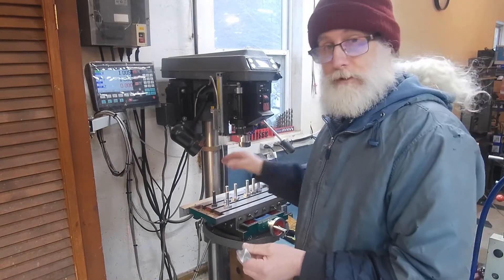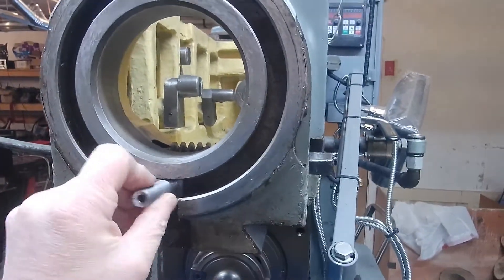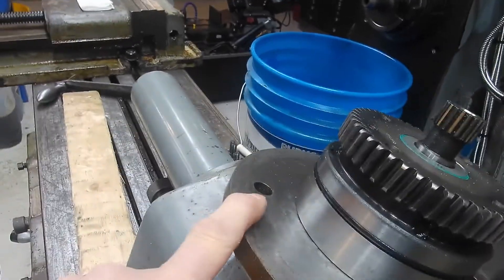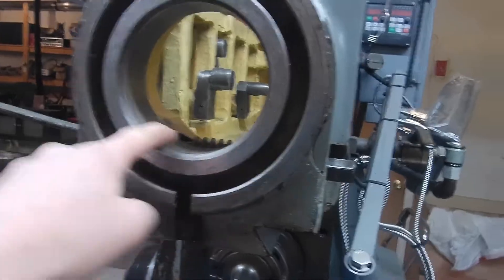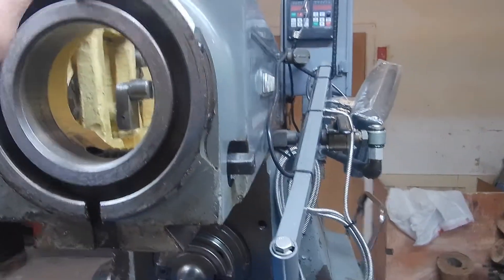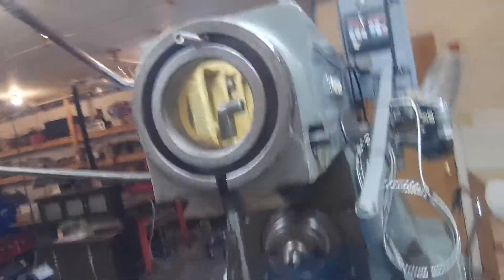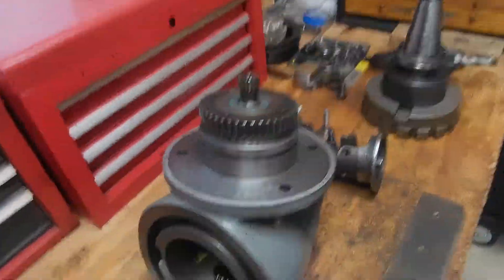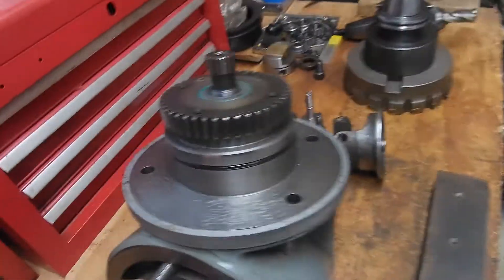That video is in progress along with the rest of the Cincinnati mill repairs. The T-bolts slide into this groove here and bolt the head on using the flange. The nose goes into the bore, which keeps any lateral movement from coming into play, holds everything tight against the face, and also prevents rotation of the head. The same goes for the knuckle — the head goes on the knuckle face, and the other face goes up on the end of the overarm.